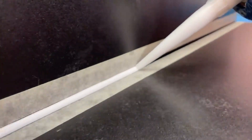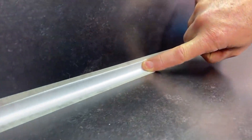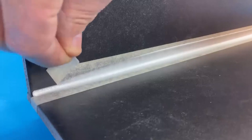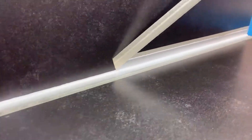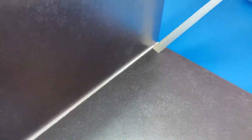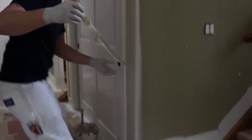Here's where patience is a virtue. Step 4: Before the caulk starts to dry, smooth it out using a caulk tool or your finger for a seamless finish. And now, the magic moment — Step 5: Gently and steadily peel away the masking tape, revealing a clean, straight line of caulk. Precision, perfection. And there you have it: crisp, clean, and oh-so-professional-looking caulk lines.